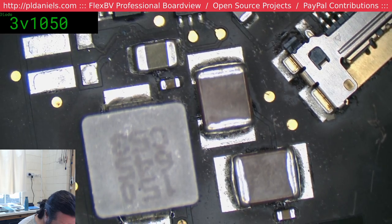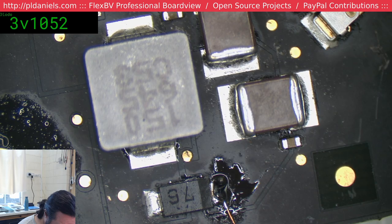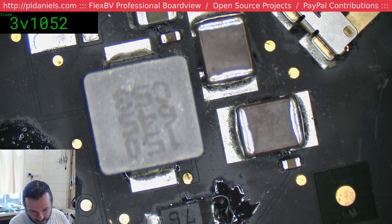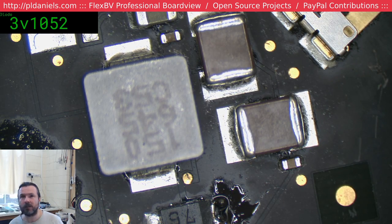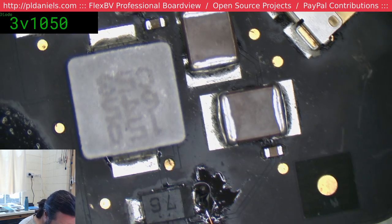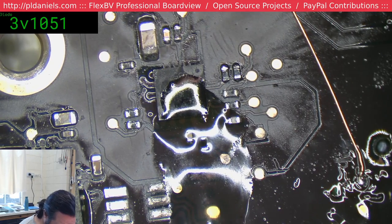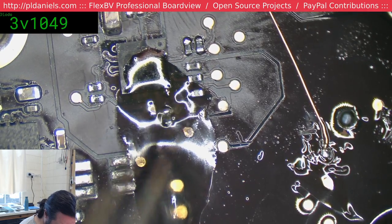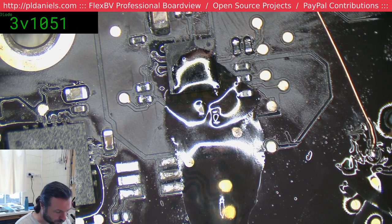And there isn't really a lot of damage here as such. I mean, I could replace it anyway, even though, like I said, the diode mode readings are just fine on it. But I'm disinclined. Given that all the damage was in this area here, it makes more sense that we would find our culprit in here somewhere. So I think I'm just going to wipe out all the resistors, check the pads again, make sure I haven't missed something.